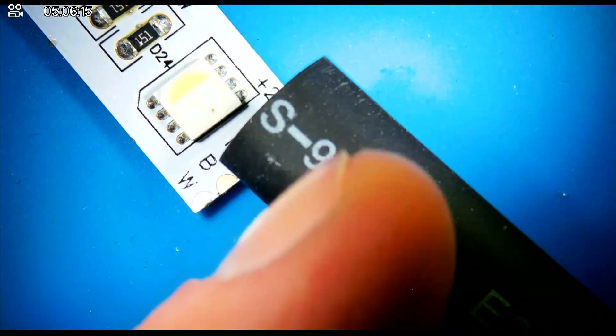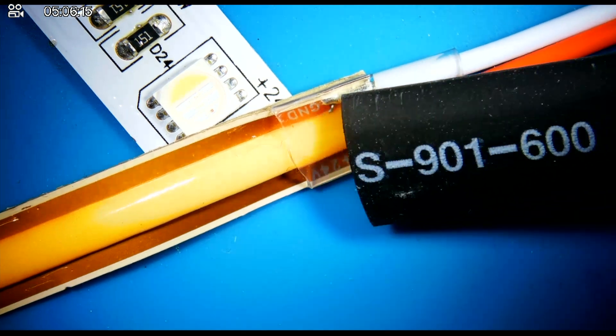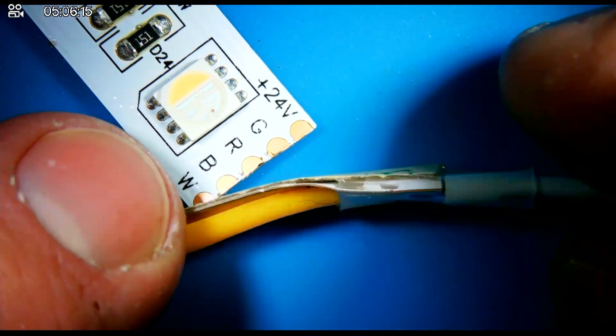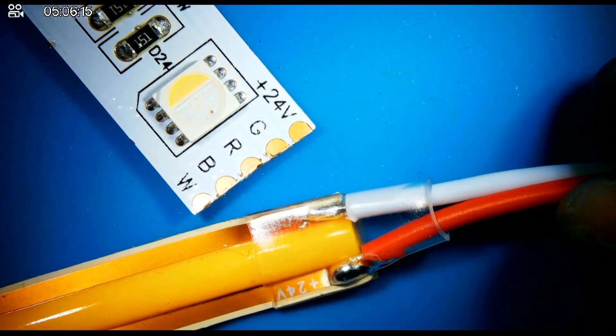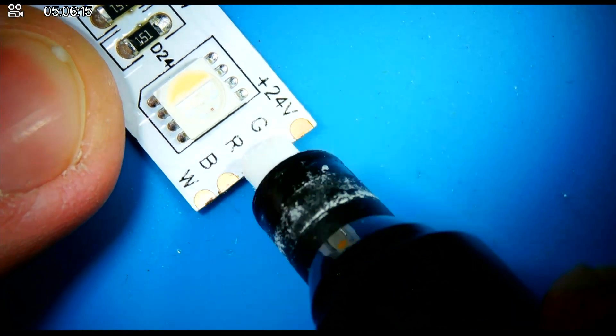You see the wires are way too long — if we solder them like this they could be bent and then touching each other. On this one I put very much on it to show you that this is also critical because then there is not much space, especially for RGBW. So this is what I came up with — I think it's better now. If this line is coming from the ceiling and you have lots of meters of LED strip, it's super important at this point to cover it up. This shrinks under heat but then it's nicely covered and there cannot be a connection.